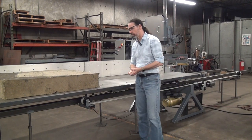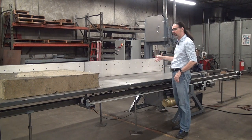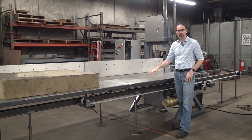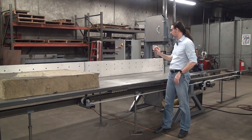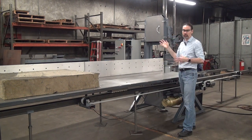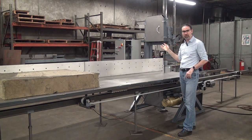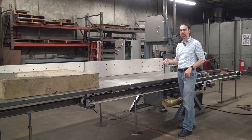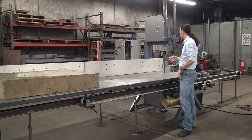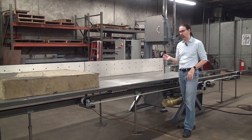This is a demonstration of the Forrest Manufacturing Model 204 heavy vertical blade traveling table bandsaw. This particular machine has our pneumatic blade tension. Based on the Model 204, we have added pneumatic blade tensioning, so it uses an air cylinder and an air pressure regulator to control blade tension instead of our usual screw-over-spring mechanism for the smaller saws. It allows us to include a blade breakage detector.